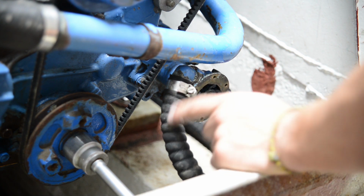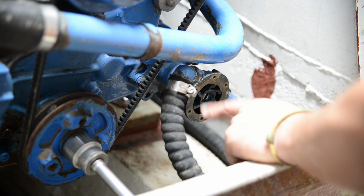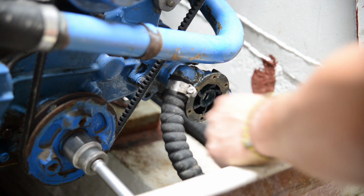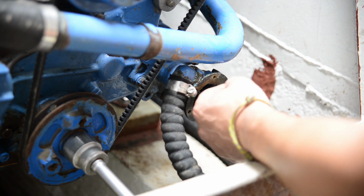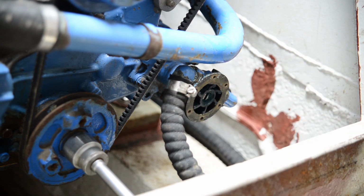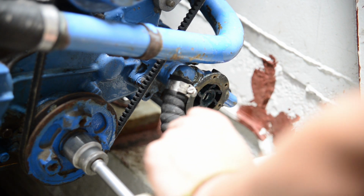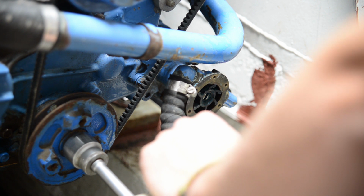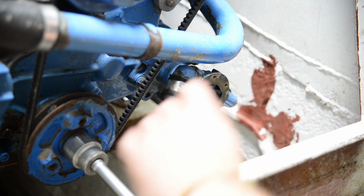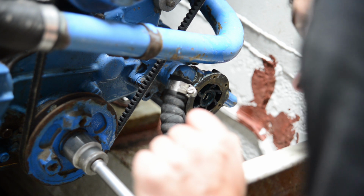So what should happen is the water should be sucked up from the barrel through this hose by the action of this pump moving this way. And it's not doing it, and I can't figure out why. It should be able to create a vacuum, so this should all be fairly well compressed, and it is. I suppose the next thing is to take it out, because this is a brand new impeller, but maybe I've kind of screwed it by all this messing around I've been doing. So I guess I'm just going to take it out and see how it looks and go from there, maybe.